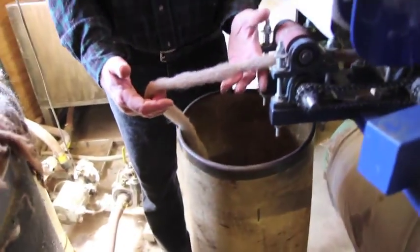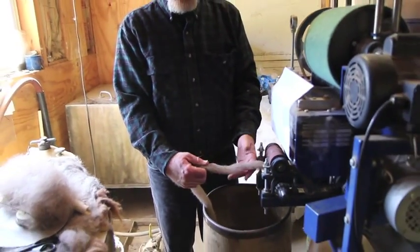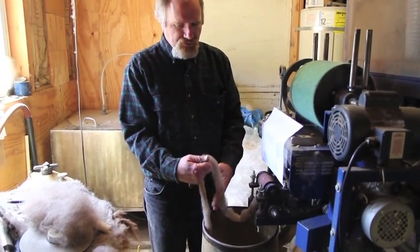And the carder works on a process of working and stripping. If you take a look, you can see right there how the fiber is pulling down, and it's starting to actually align the fiber so it's all being combed in the same direction. That's the whole point of the carder, is to line up the fiber and make it all go in the same direction. And once it gets to that worker and stripper, stripping it all through, it'll come out here. And that's what this is doing, is now the fiber is all lined up, and this is what's called roving. And roving is what hand spinners will actually use on a spinning wheel and turn their fiber into yarn.